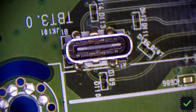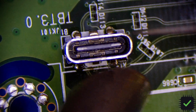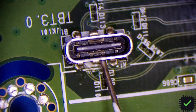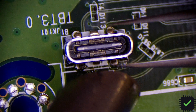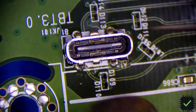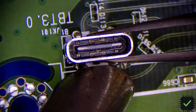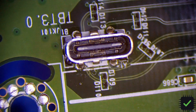I'm going to adjust the current temperature. The posts are already kind of loose, but I just want to make sure I'm not going to rip any contacts while removing the connector. This might be a little too much heat, so let's bring it down to 720 Fahrenheit.